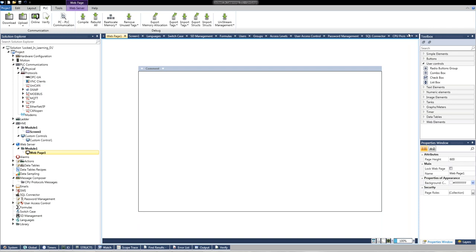With the virtual PLC, what happens if I lose network connection? Am I going to be able to control it somehow? So the virtual PLC's screen is just sitting there as a VNC server. You're going to connect to it. The main goal would be to control it through the ladder and through the process, and not necessarily rely on user input, especially if it's related to safety, because at the end of the day, there is no physical screen. So if you're relying on that physical screen, it's probably a good idea to have a wired control backup, like a button or something like that.